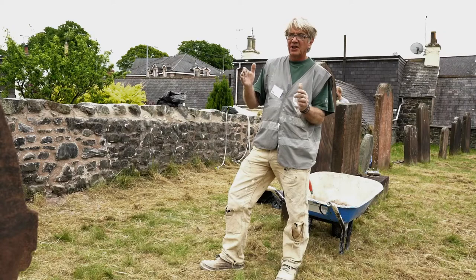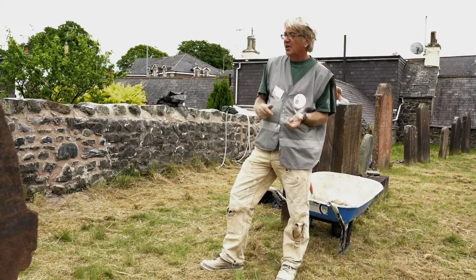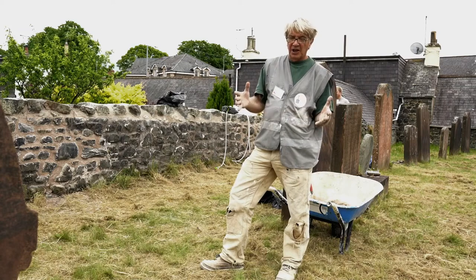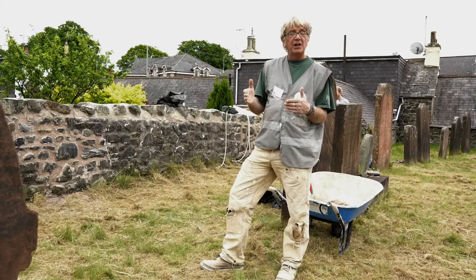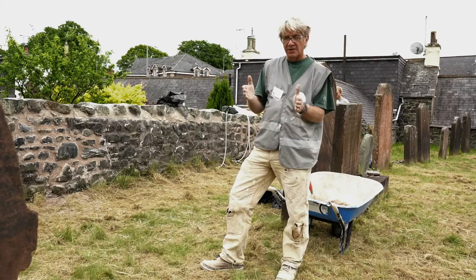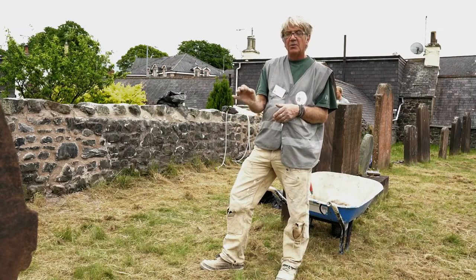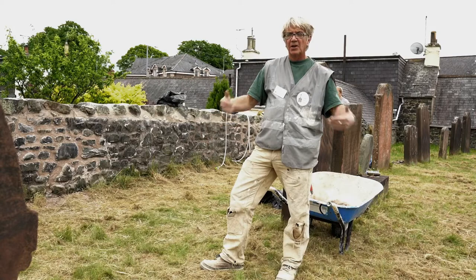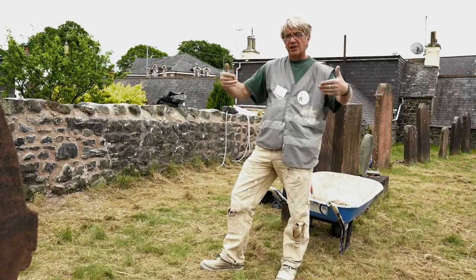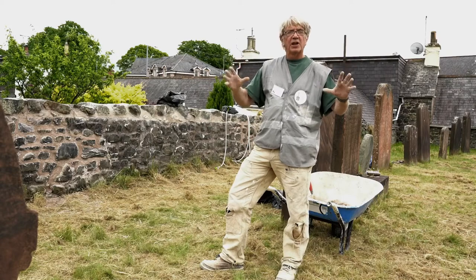And if this was a house wall, in this town and in most towns in the UK over the centuries, these buildings would at least be lime washed. They might be rendered, harled as it would be in Scotland, a very thin harl, but that's applying a fully breathable coat over the whole of that building that is going to receive a little moisture but get rid of any moisture, either from within or received, as quickly as possible.